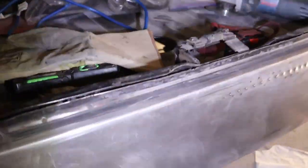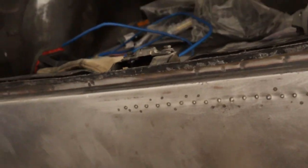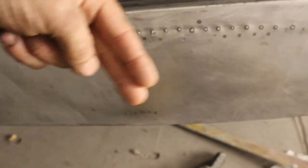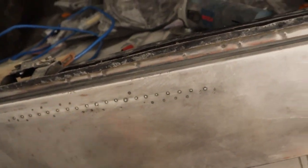There we go — in light of this exciting new development: rust. I didn't think these were rust, but of course they are — they're right through. So the bottom two inches of this panel is shot. The question is: do we make a piece and cut this and weld it in? We have to assume it's rotten from here all the way to there, which means we have to cut at least that section. You can see there's some shape here — it still bows towards me.